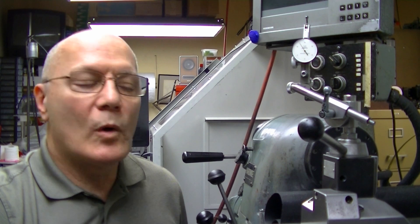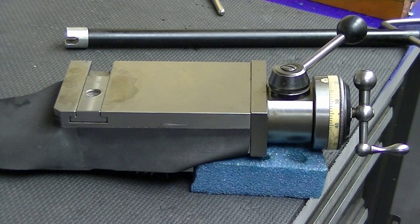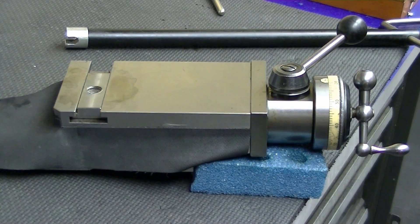Let's look at why replacing the compound can improve the performance of your machine immensely. The compound is the weakest link in the lathe, especially on small hobby lathes where the finesse in fitting the gibs and the quality of the fit and design in general is compromised. The T-slot — even on the best of them — is ridiculously small. No matter how tight you tighten your stud for your tool post, it will still spin. This compound is in exceptionally good condition — probably better than when it left the factory, ground dovetails, scraped — everything's perfect — and it's still the weak link.